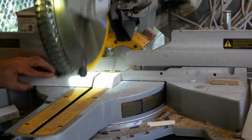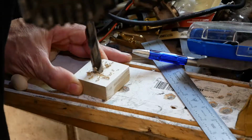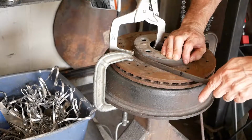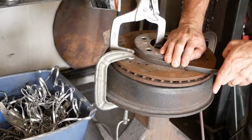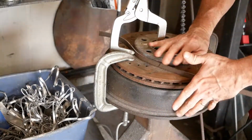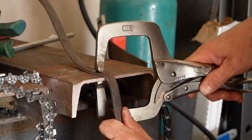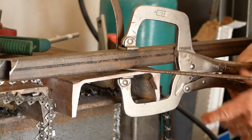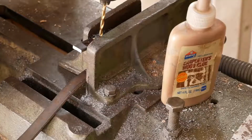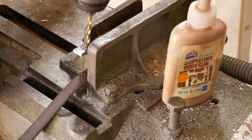Most of the brackets are made with 2-inch lengths of another piece that's cut the same length and dimension. For the first set of brackets, I drilled a hole in the back of them, stuck a dowel rod through, and glued the backside. For the second half, I took some flat stock steel that I had, bent it into kind of an S shape, and then squared it over to make a bracket for hanging the helms. And that keeps the helm a little closer to the wall, but still gives it plenty of strength and structure to hold particularly my Mandalorian bucket, which is made out of steel. It weighs a little bit.